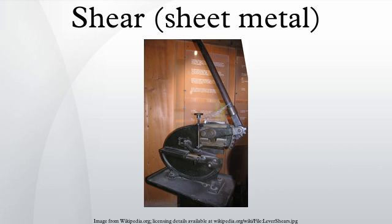It is electrically welded together to make it a sturdy, stable unit capable of withstanding higher stresses due to heavy-duty usage. The foot plates are reinforced with bracing angles so that they give firm stability to the shear. The machine is provided with section knives with sliding blades which can be adjusted by hand to make 90 degree cuts on angles and T-sections of different sizes, as well as with openings for cutting round and square bars.